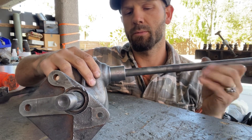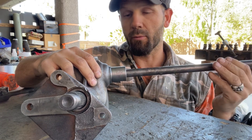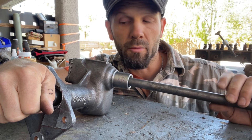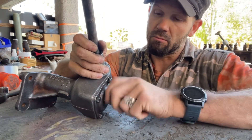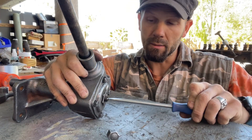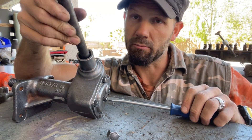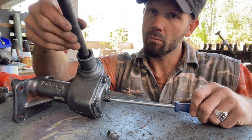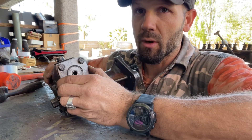It's about four and a half revolutions — I'd say a little bit less than half, but about four and a half. There is a little bit of inherent wobble, about that much. I don't know if there's any way to tighten it up because on an older system like this there's not much adjusting. This component just moves the shaft in and out. I put it all the way in and all the way out to see if it changed anything — it did not, still the same amount of looseness. The only other adjusting you can do is how many shims you put right here.